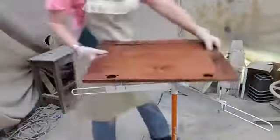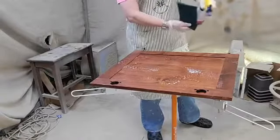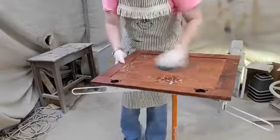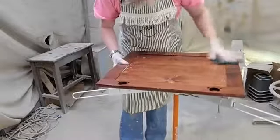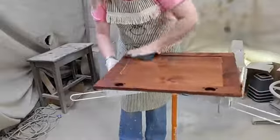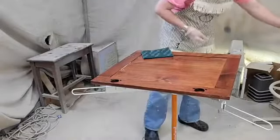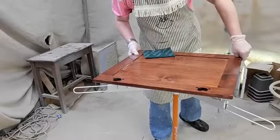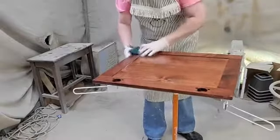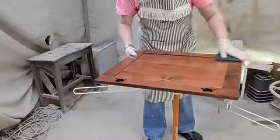This is even the back of the door — I want you to see the front of the door too. This is not about anybody's housekeeping; it is about living in a house and that's what it's like. Typically I start by spraying my pieces really well. Everything attached to the wall I do by hand, but I spray these doors and scrub thoroughly. You want to make sure you get in all of the creases and crevices, because any oils you leave on this door or cleaning products that have been used on it will bleed through your paint, no matter what you do.